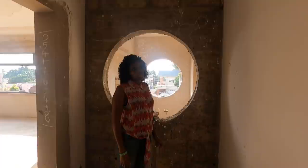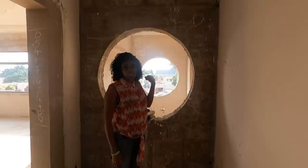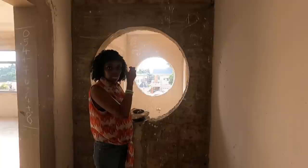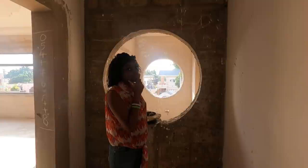Okay. What's the purpose of doing that as opposed to just plastering? I find that plastering is very messy. It's very messy, and I think it's more time consuming, and also the ceiling line, right at the top. I only want a small bit attached to it. But also, with the plasterboard, they can cut the circle to precision. If it's the mason, they have to dress it. But with a plasterboard, they can cut it to a perfect circle, and then we'll get the glass to slot in.